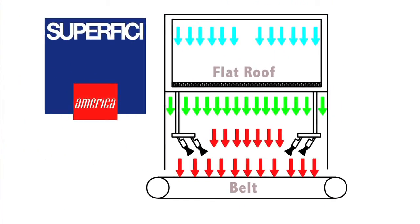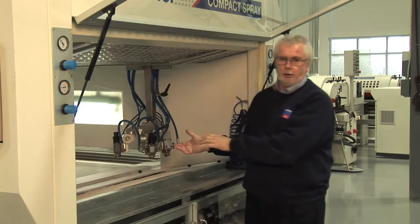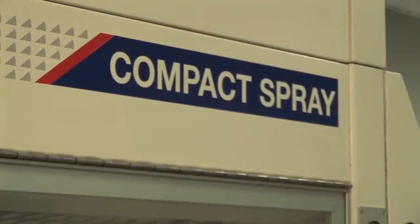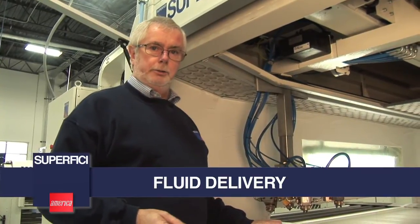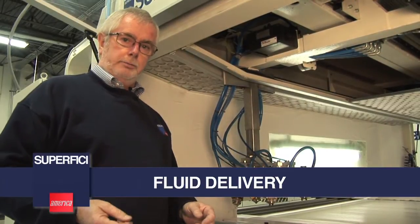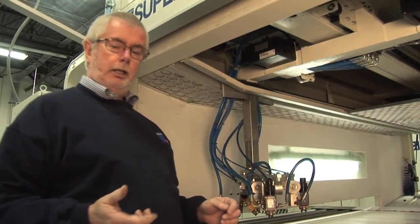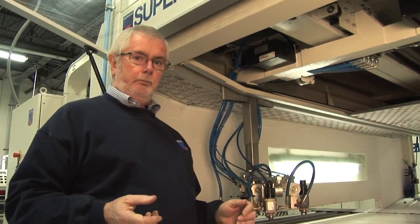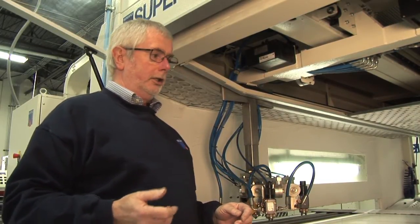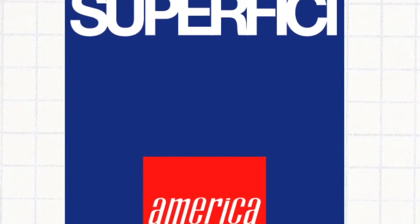When it goes on top of the belt, we're able to either have more on the workpiece or we're able to recapture it through our recovery system. Another key feature of an automatic spray machine is to consider how the fluid is delivered to the spray guns. It's very important that you get as even pressure and as controlled flow rate as possible through the spray gun to enable each gun to give the same amount of fluid onto the workpiece. Many of our competitors' machines do not operate a full closed ring system. This can lead to great inaccuracies in the amount of film applied gun by gun. We avoid that by having a closed ring system.